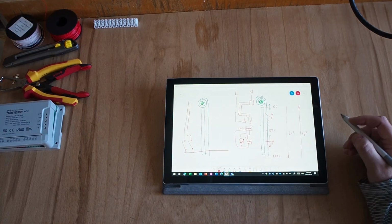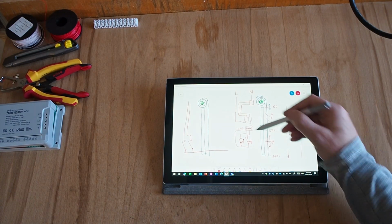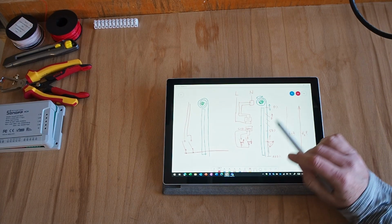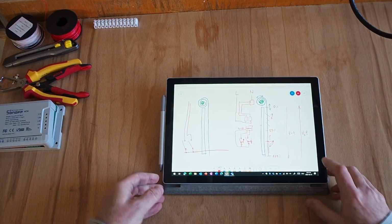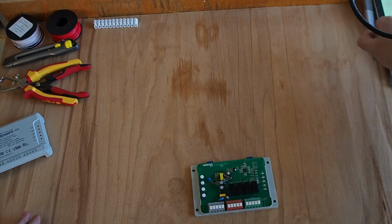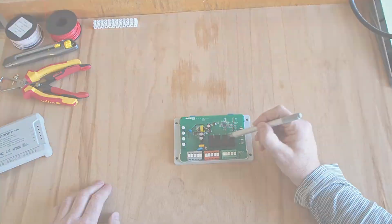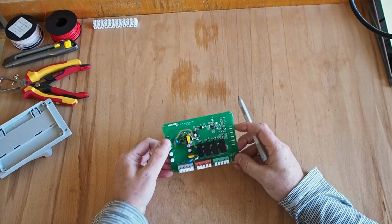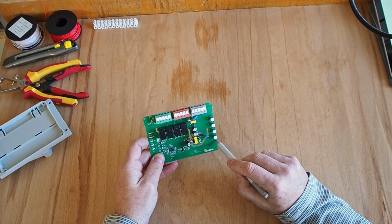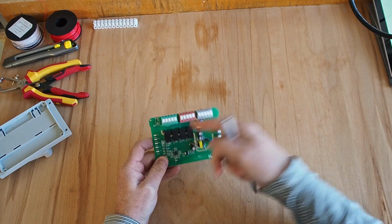Now that we know how to do it, we can start building it. I could get a Wemos Mini or some other microcontroller, but the easiest and cheapest way to do that, in fact, is to get a Sonoff 4-channel that has exactly what we need. We have 4 relays, and 4 buttons, and those buttons connect IO 0, 9, 10 and 14 with the ground to close the relay.